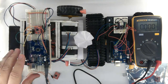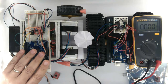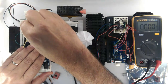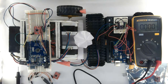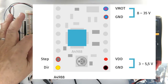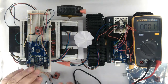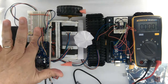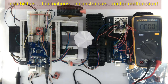It seems like everything works fine at first — but not so much. Now let's remove RESET and SLEEP, leaving only the direction and step pins connected along with the power pins for both the motor and driver supply. Run it again and what you get is instabilities, fluctuations, inconsistencies, and motor malfunctions.